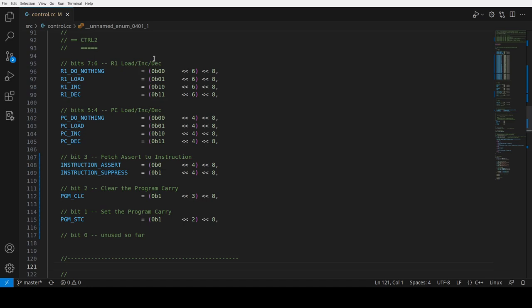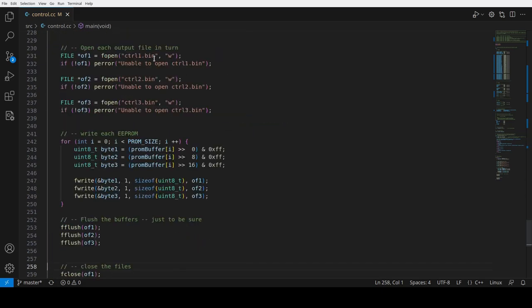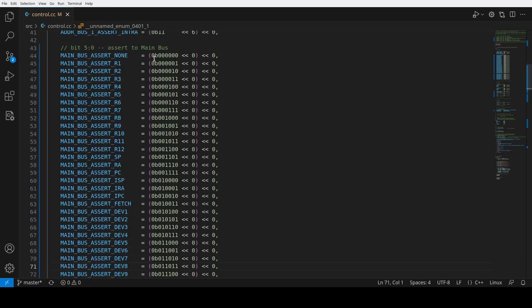Clear carry and set carry are easily moved to ROM 2, since I haven't got those in permanent wire yet — still just temporary hookup wires. I also had to update my fetch assert main constant so it represented the change in logic. All the rest of the code did not change, so that proved to be a relatively simple change. Now I just need to go update the breadboard to reflect these changes. What makes it really easy is I know exactly what changes to make because of the tracking that happens with Git.